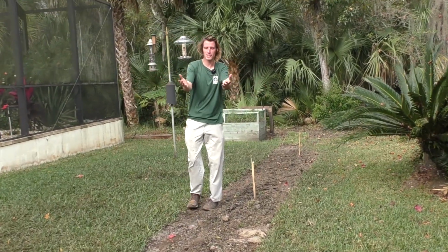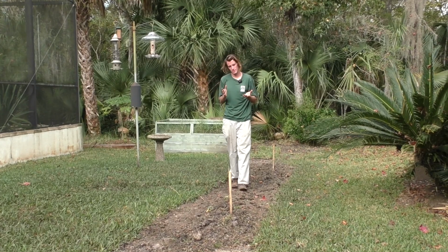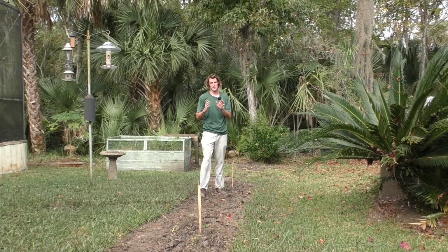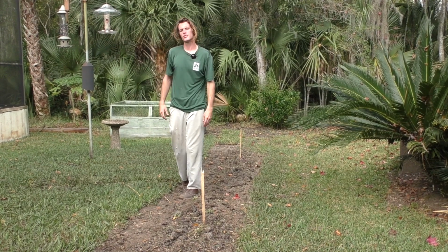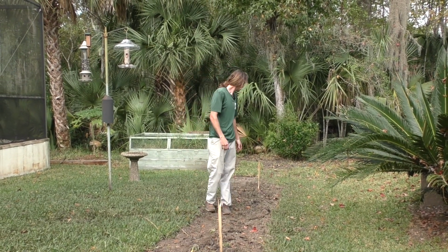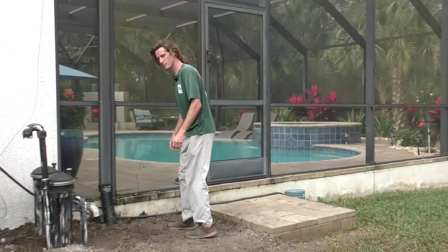Well, these 2 yards come together in a V shape, right? So we tried to put this French drain still on the customer's property, but as close to that V shape as we could. But what we also did was we sent out some little legs, little 5-foot legs to each side. 4 of those to capture water to each side of the swale as well. Try to maximize our uptake on that because this was a very, very wet side yard.